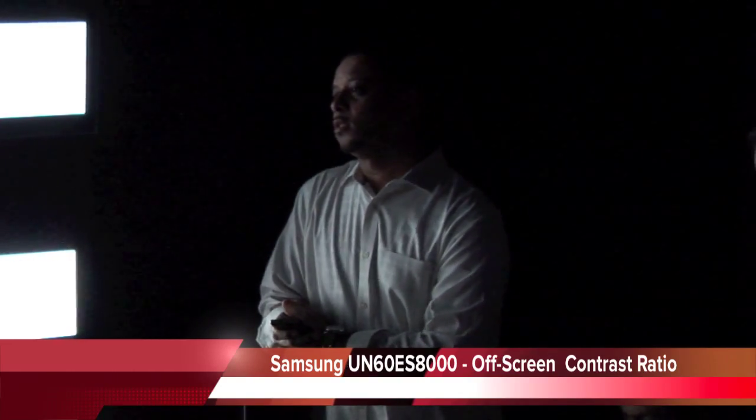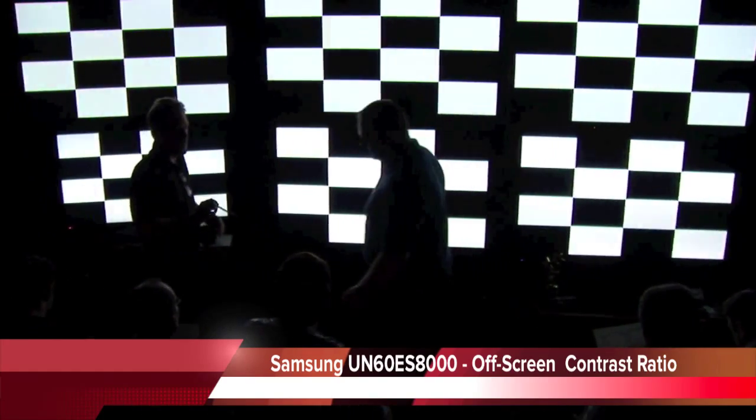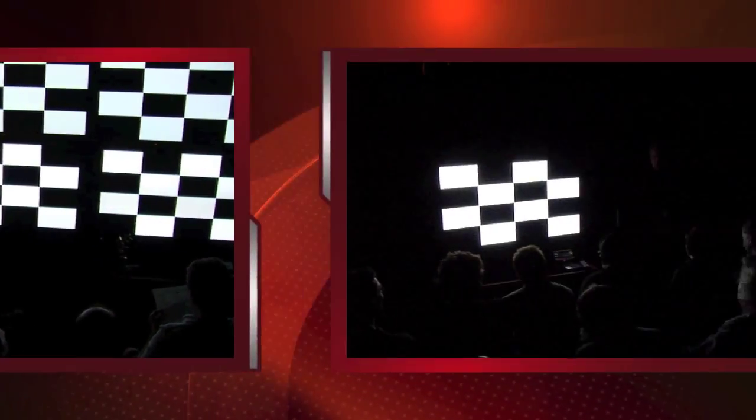336.67. Okay, that's actually a really good number. Compare it to the Samsung 60 ES8000 on-screen number you have on your sheet. You'll see it's extremely small by comparison. To give you just some reference, in a movie theater, you get around 150 to 1, with the exit light on and the LED lighting along the rows and stuff like that. You get about 150 to 1 in the movie theater with film.